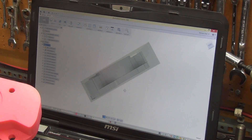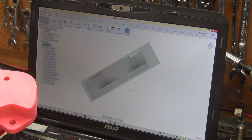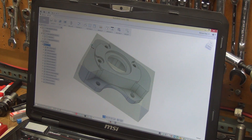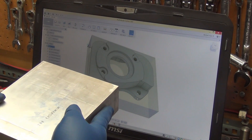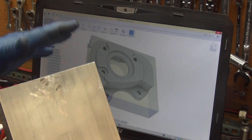I also made this flange a little bit thicker because I could — I wanted to try to use up as much of the material as I could. The more you take away the lighter it is, but the more you leave the stronger it is, so I'm looking more for strength than lightweight. Originally I was going to set it in the mill like this and cut it, then flip it over and fit it in the soft jaws. But these are my bandsaw cuts.